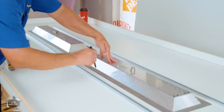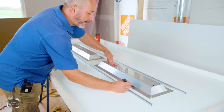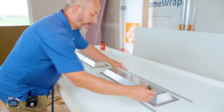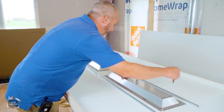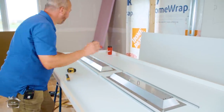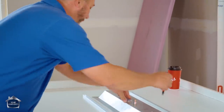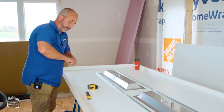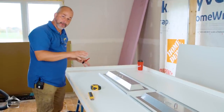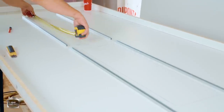Now we're not actually making the hole in the table that big. We're gonna make the hole in the table about this big. We'll go to the middle of the flange. Okay, so it's a lot easier for us to set this in place. But just by tracing this out, it'll give me a point of reference when I'm setting my insulation, the rigid insulation. I'm gonna cut and install that onto the table here, because it's also 2 inches thick, and it will keep the concrete from filling up those holes while we're pouring, all right? So that's done, we can get rid of these. The only thing left for us to do is set up the glass.